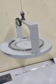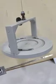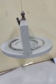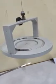Since the vernier constant in terms of centimeter is 0.01 centimeter, the vernier scale reading multiplied by the vernier constant will give you 0.04. So your total reading will be 10.14. Look at the table. 10.1 is your main scale reading. Your vernier scale reading is equal to 4, so the vernier scale reading value is 0.04. Total reading will be equal to 10.14.